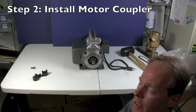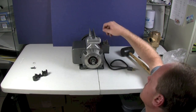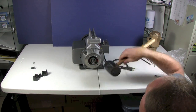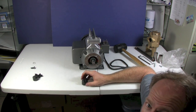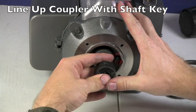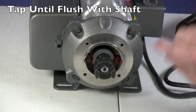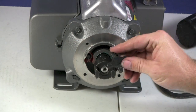The second part is putting the coupler on the front end of this. There's going to be a ring that comes with it — you'll take that ring off of the motor and there will be a shaft coupler in here. This is where the rubber mallet comes in handy; just make sure it's in good and tight and nice and flush. These couplers are 14 millimeters on both sides — one for the motor, one for the pump head — and they go on fairly easily. To put the coupler on, line up the notch with this piece and push it on. Tap it in with the rubber mallet, but don't bring it in too far — you just want it flush. You don't want it sticking through because we don't want it getting in the way of our rubber gear.